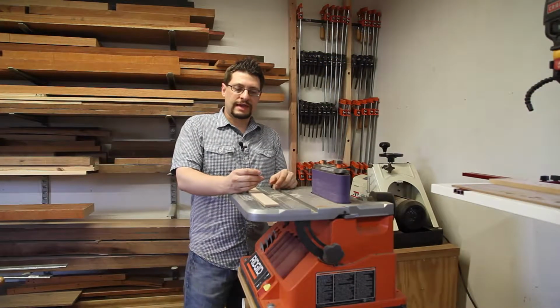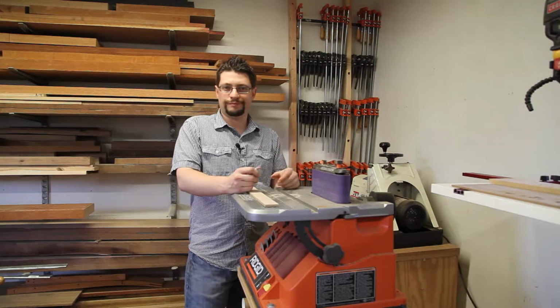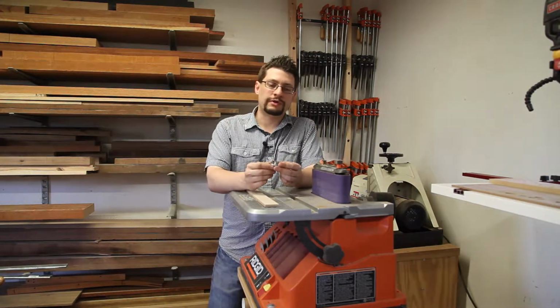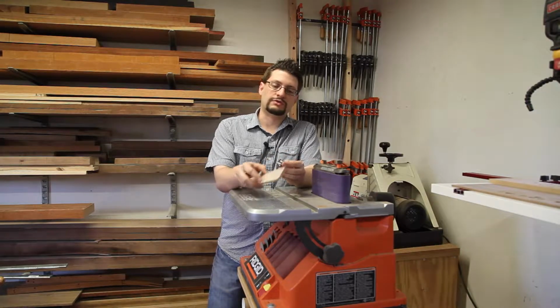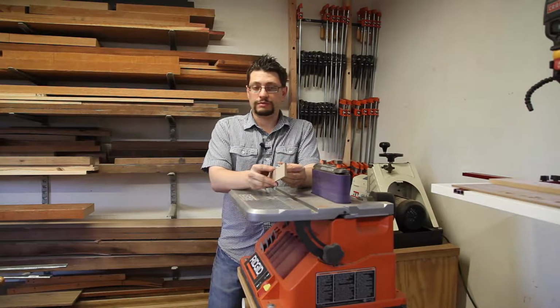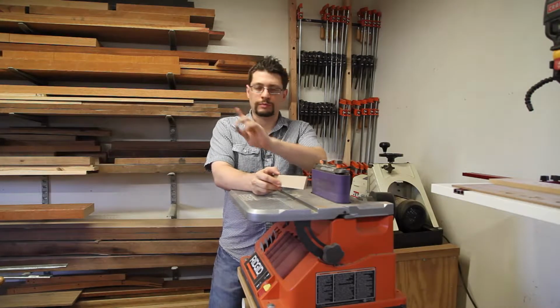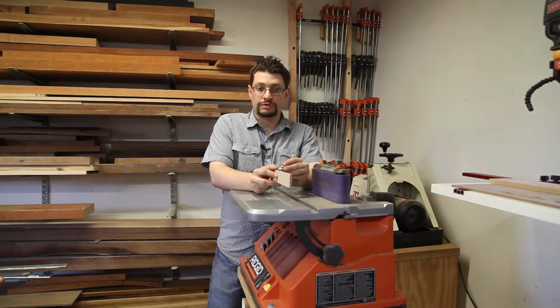I'm over here at the sanding station, and I've been sanding for maybe 20 seconds or so far. And basically I'm over here because the length of the bushing itself is longer, or deeper, however you want to look at it, than the 1/4 inch MDF I'm using for my template. This is a new bushing. I normally have one that's already been shortened, but for the purpose of the video, I got a new bushing so I can show you this.